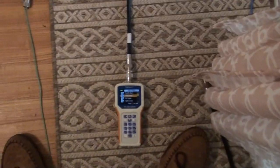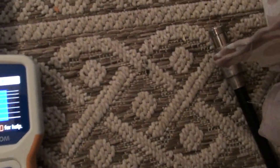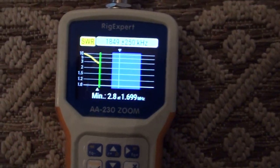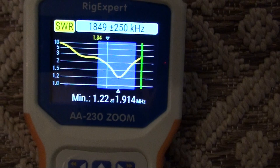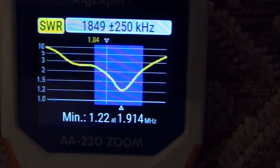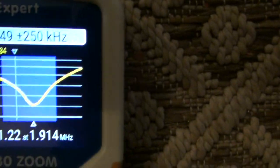This is what I want to show everybody: the interaction between my two antennas. This is my new inverted L that we saw in a previous video, so we're going to sweep this thing SWR-wise. Let's do a sweep on the SWR. This is for 160 meters — that's where the antenna is resonant. It has this really weird double curve; the dark blue portion, and the light blue portion is the actual 160m band. It's resonant and the lowest SWR is 1.22 at 1.9 MHz.